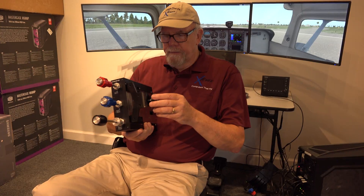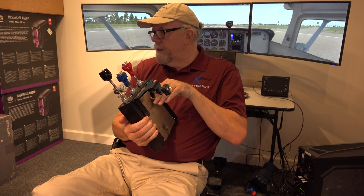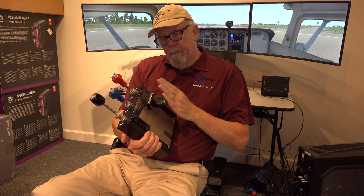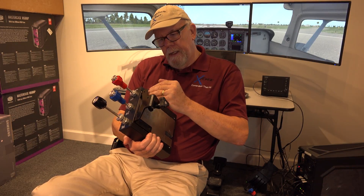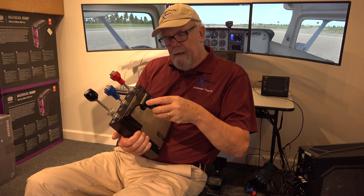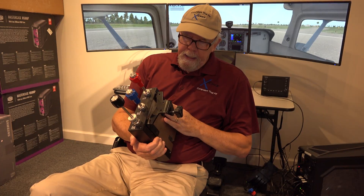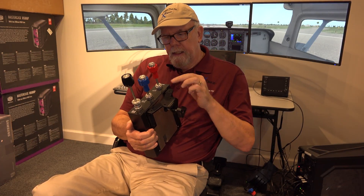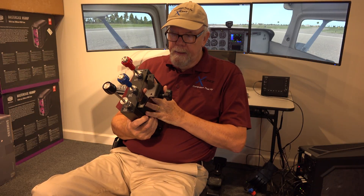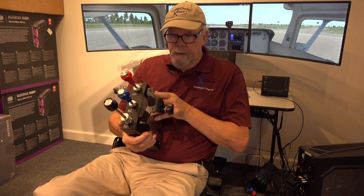At the bottom, you see here it has a very nice sturdy clamp, and as long as you don't have a lip underneath your table, this will fit quite nicely. Even a little bit of a lip will work fine, but if the skirt comes out too far, it won't work properly. But this is a fairly stout little clamp, and it's obviously metal. In addition to that, you can actually take the front off and use this in a panel — you can take the clamp off altogether and just slide it into a slot on a panel and fix it in there with screws that you provide.